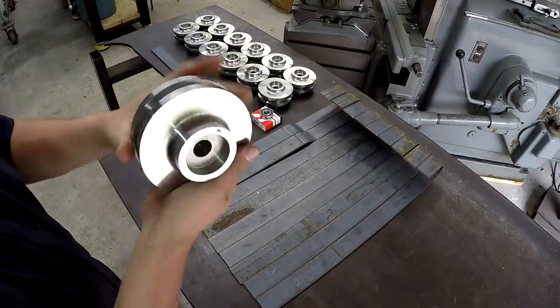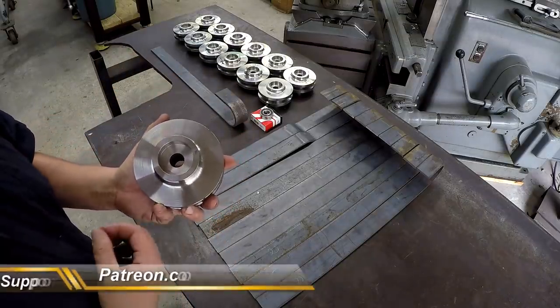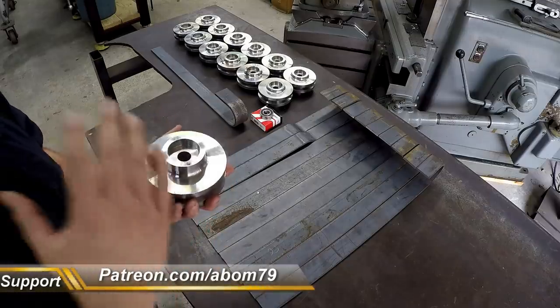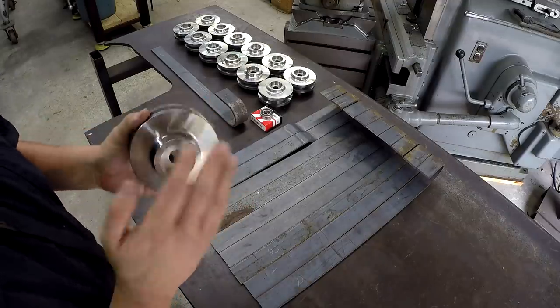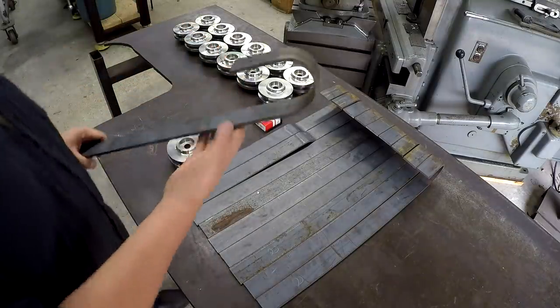So the only thing we got to do to the rollers here is we need to drill a relief hole through there. So we'll probably use an 1/8 drill bit and just drill a hole through there and chamfer each side. All it is is clearance, so it's not important to have a nice smooth finish through there, you know, a bore or ream finish. So we'll drill those, and then all of the brackets here, there's 10 of them in total.